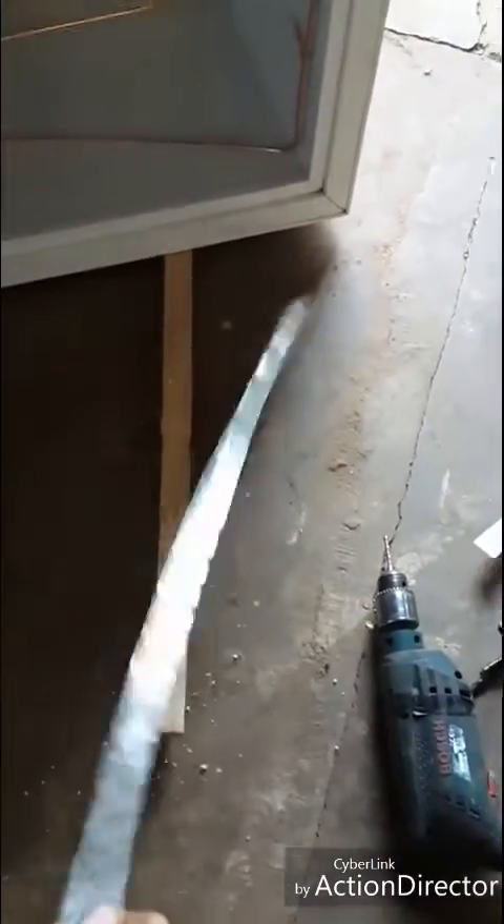Here are the pipes that are sticking out — there's the new suction line and the hot line. So now I've cut these strips out of galvanized plate. It's quite thin and flexible. This is going to go in here and we're just going to separate the plates, pop it down, drill some holes with a 4 millimeter drill. And done and dusted. All the pipes are in and they're all held down with these galvanized strips and a load of pop rivets. That took some time, but that's done now.